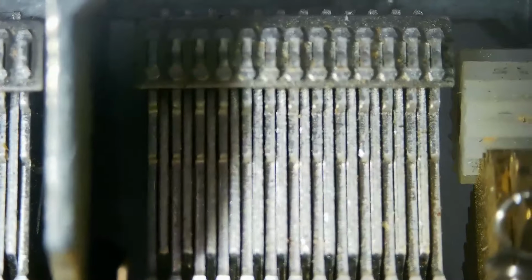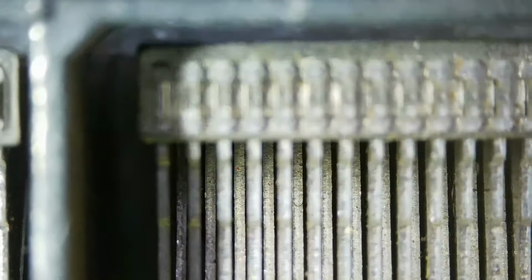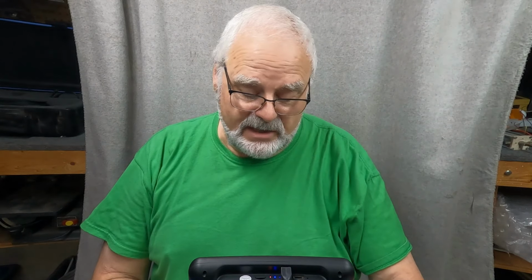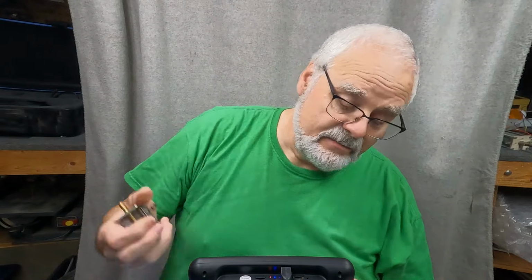and we'll look. There's barely a thousandth of an inch spacing there. Here, I'll turn it again. You'll see one of the sections starts to move. So almost impossible to square those away if you ever screw one up. Anyway, let's go back up. So those are the transmitting sort of capacitor, and of course the higher voltage that you want to use, the greater the spacing you're going to need. You look at that and you go, okay, wow, quite a much larger spacing.